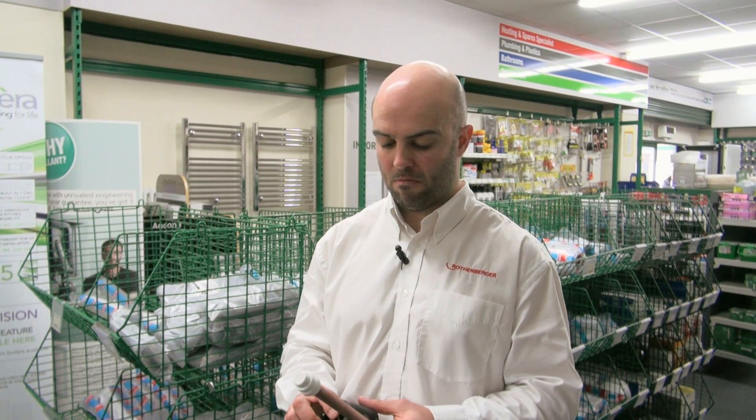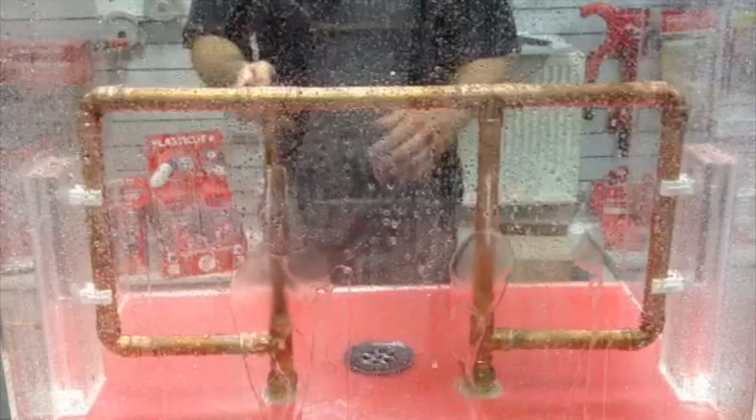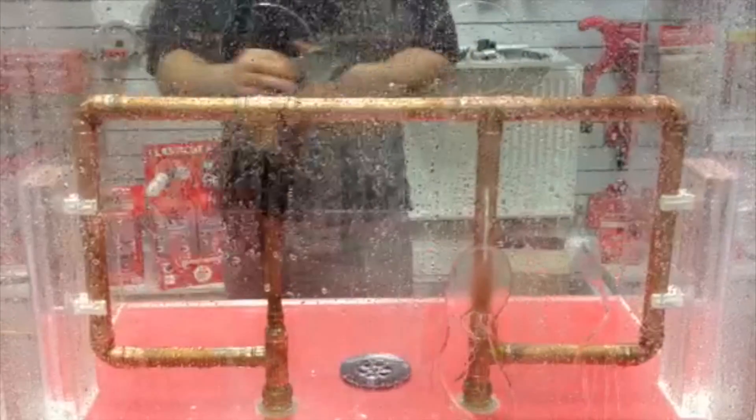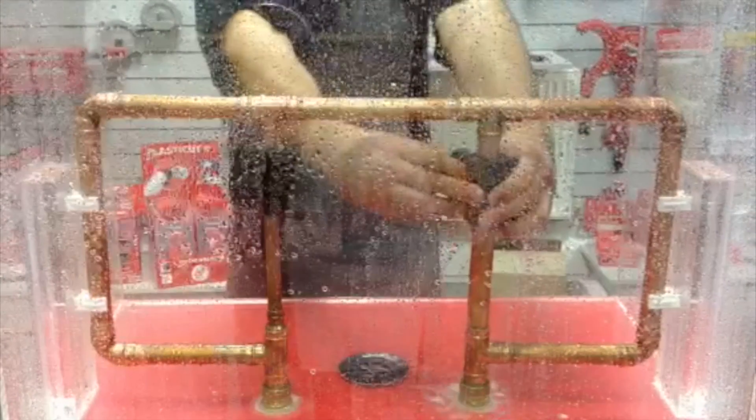Development plans: we're making it for different sizes and for bends, tees, and other fittings. It's very quick and it's got a cavity which can accommodate large bursts and pipe fittings. You can fit it with one hand and it's got good chemical and temperature resistance. It's a really simple no-brainer that you can have in your toolbox and fit in a second. If you get a burst pipe situation, instead of having hundreds of pounds worth of damage — which can be caused in no time — you can put this on and just keep going. One mains water pipe can lose a thousand kilos of water in one hour — that's a ton of water — so that's how destructive a burst pipe can be. With this, you can fit it to copper and plastic pipework.